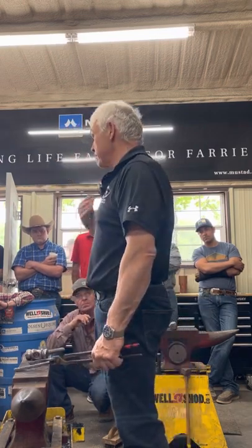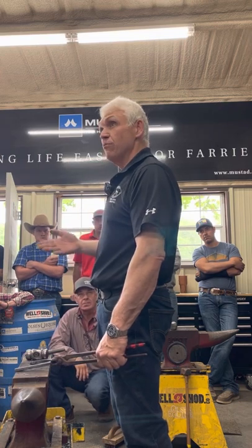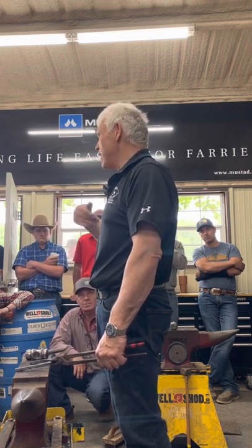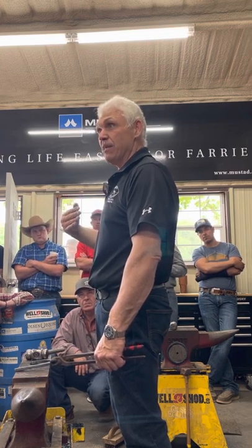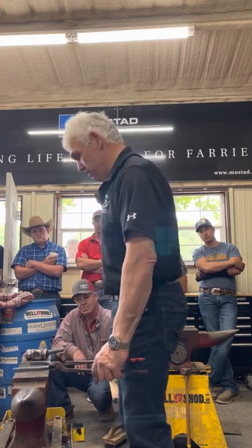Step is full at the 60%, move the outside edge, move the garniture, wrap the hoof side, wrap the ground side, full at 100%, stamp it, level it, stamp it to the anvil, pritchel it, level it, pritchel it.